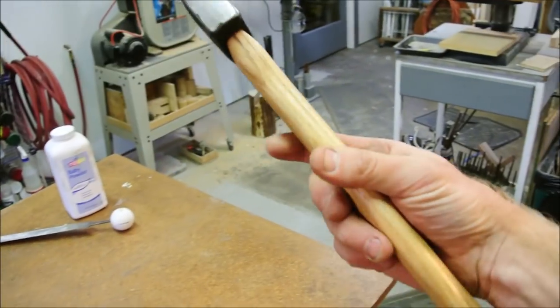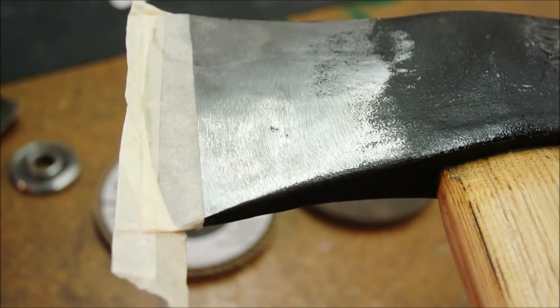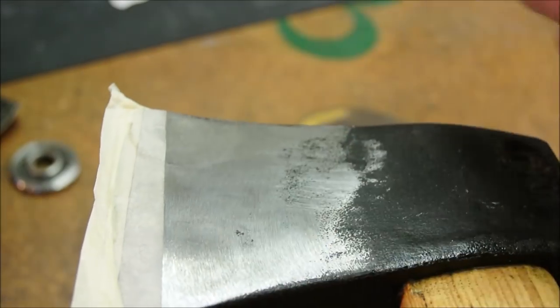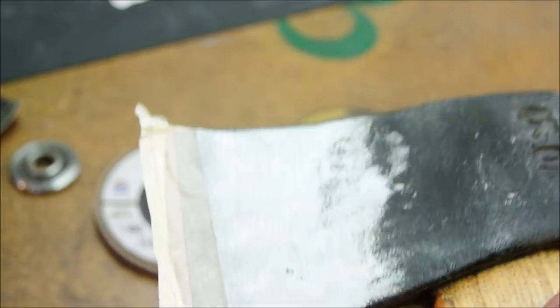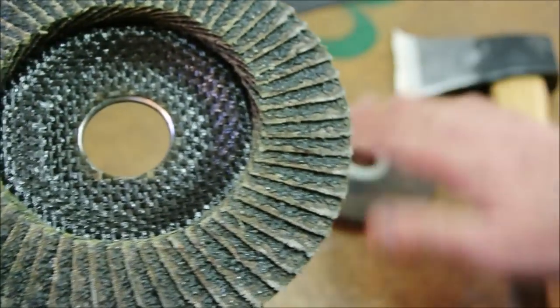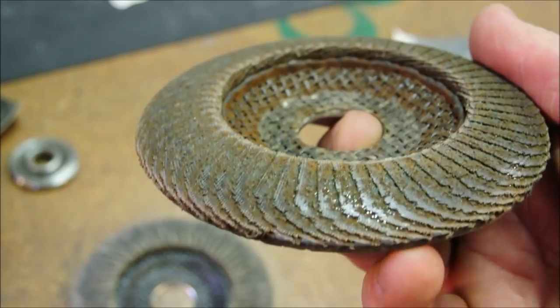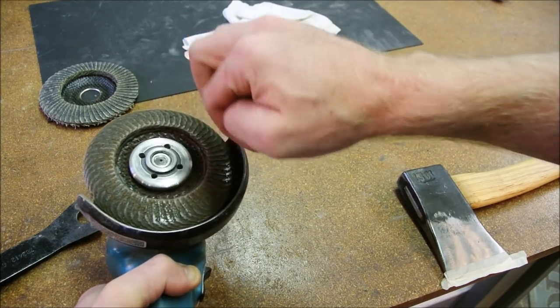It's coming along nicely, but before it can take its permanent home over there in my log, two processes remain — I want to polish it and I want to file the bit first. The polishing — take a look at the scratches left from the original grinding. I want those scratches to be smaller and I want them to go in the direction I'm actually using the tool. I'll use the old worn belt — there's barely anything left, it's pretty much just fabric rubbing at high speed. Done correctly, it will be shiny and there will be less friction with each stroke.